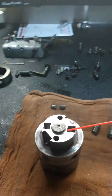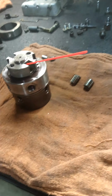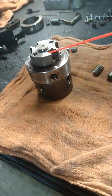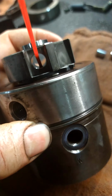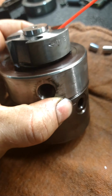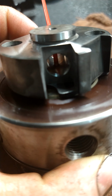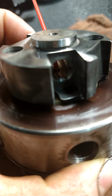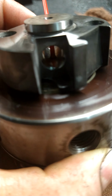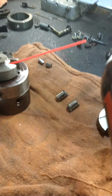And you don't want that, because for about 24 bucks you can get a whole new reseal kit, take this thing all apart and clean it. So what I normally do is I'll take some brake clean, and I create a couple little bends inside and on the nozzle there, and then there's that hole. That hole in the center is where all of the fuel basically comes in and out for this pump. And then what I do is, I'll get this thing hooked up here a second.